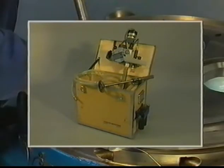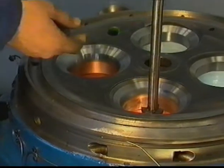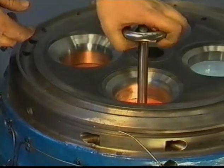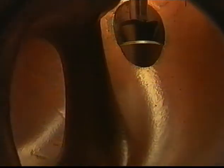The Chrismarine seat grinding tool has a very accurate factory set grinding angle. Since the angle of the seat and valve are not identical, it is not allowed to lap valve and seat. Always use the instruction manual delivered with the valve seat grinding tool. Use the special hand tool to make a small conical rim in the valve guide.